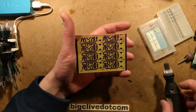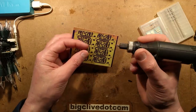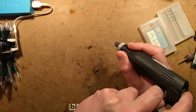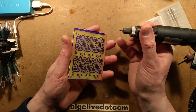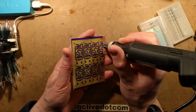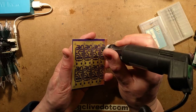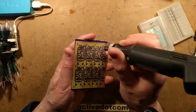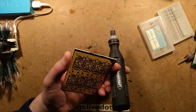I've had other experiences where it did knock pads off when I wasn't getting good adhesion, but in this instance it's been fine. It's a very fast way to etch. Now that I've etched it, I'm going to leave this dark bluish-purple coating on and use my favorite mini craft drill — which came from RME Electrical, Radio Mechanical Electrical in Howard Street in Glasgow — with tungsten carbide bits. I'm drilling everything at 0.8mm initially and then going over the larger holes, like the connector holes, with a 1mm drill bit.